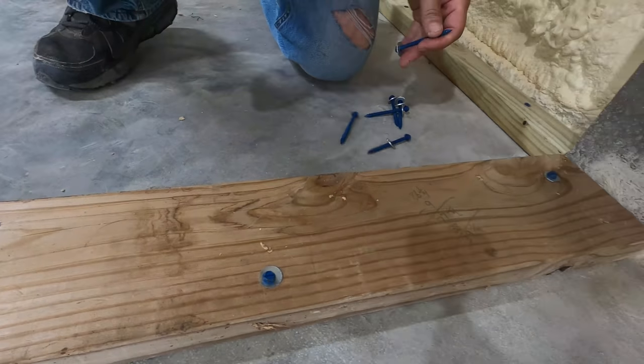Now, when you're bringing a wall up like this, 4 feet tall, that's a little taller than standard wainscoting or whatever, right? So the window ended up being a little bit lower than that. So we had to trim around the window here. And what we've done is we've just kind of spaced this out the same distance from the side and the same distance from the bottom. And the idea behind that is when we trim this window out, the window trim should go right up against this J channel, and everything will look nice and neat when the window's finally trimmed out.